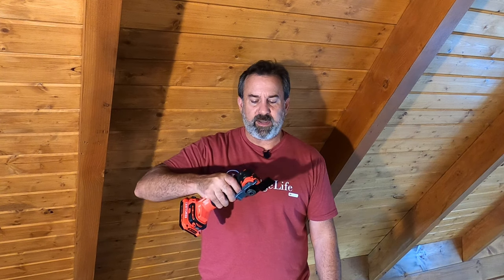When you start getting to your door facings and around odd shaped walls, it is nice to have a multi-tool. This multi-tool will help you cut under the door facings, and give you a nice clearance for your board. I'd use a vinyl plank under it and let this guide over it. Use a little cheater board, a scrap piece. It's going to really help.